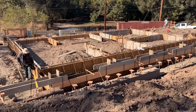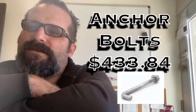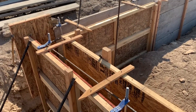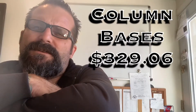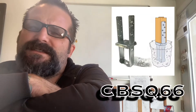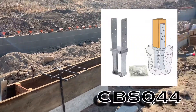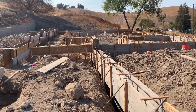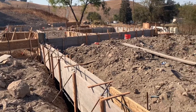The plans only called for half-inch anchor bolts but I already had hangers for 5/8s. I also had to get some Simpson column bases — CBS Q66s for the front, which are basically for a six-by-six post, and CBS Q44s for the back for a four-by-four beam or post. I needed nine of those and three in the front.